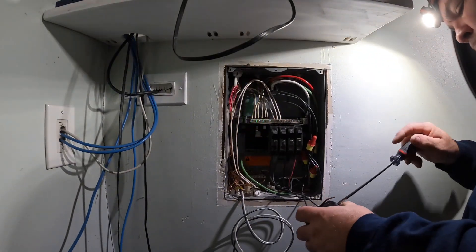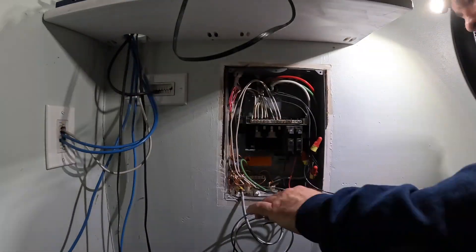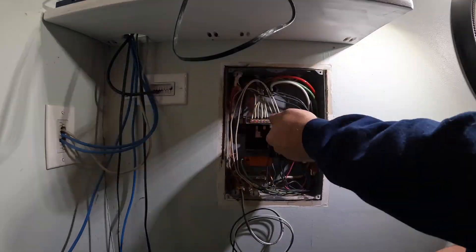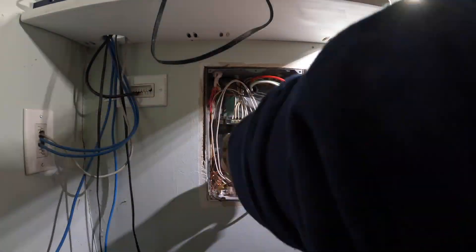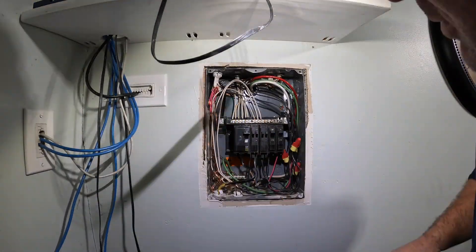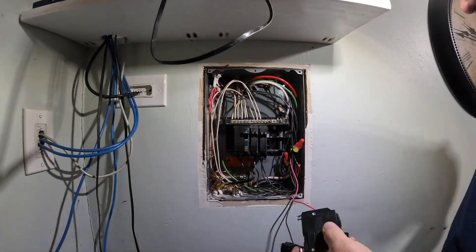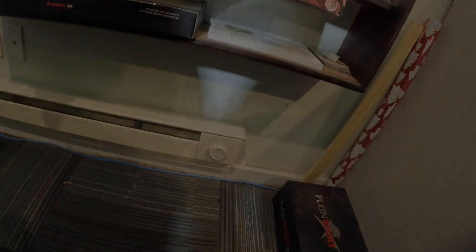That splice was the last thing I did that night, and then I took it easy — watched some KISS videos from the Garden show, but I wasn't very impressed with the lip-syncing and playing to tracks. I came back the next day and picked up the circuit breakers I needed. I installed a couple of twin circuit breakers, then put my double pole heater circuit breaker in. While I was there, I changed out the remaining old circuit breakers so there are all new ones in there — it's my house so that's just an upgrade.